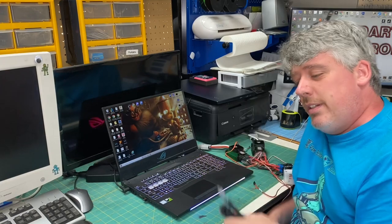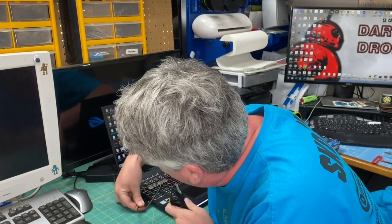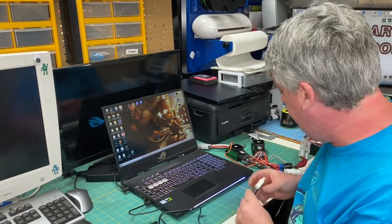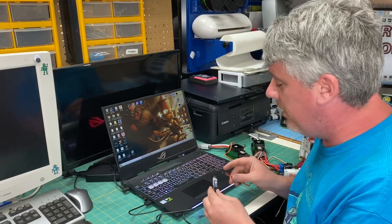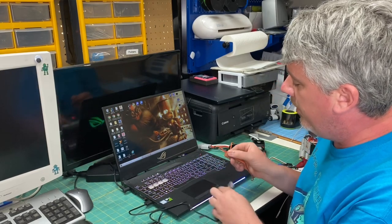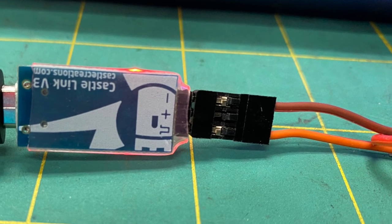Now it's time for a little bit of programming. This is the CastleLink cable — it allows me to alter how these speed controllers work. Their default settings, when you take them out of the package, are for brushless motors and specifically the fifth-scale motor they're paired with. I'm not using that, so I need to reprogram them. I do use that for our weapon setup in Season 5, so that one I could put in completely stock. For our drive system, we need to reprogram these. On the back of the CastleLink it shows a signal wire and a negative — I've removed the red wire, since I'm supplying power via the battery; otherwise you'll fry the CastleLink.